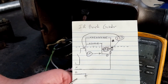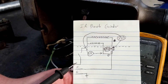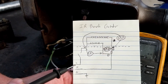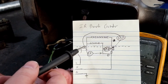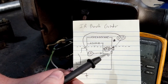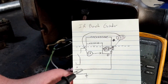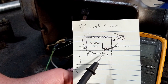These are our main lines coming in — we have a main power or the line, a neutral, and a ground, coming from the outlet. When it comes into the grinder it goes up to a switch. That switch splits off into two different coils. Both coils are connected via the capacitor.